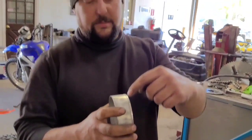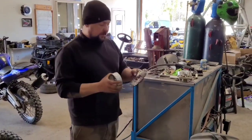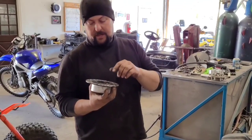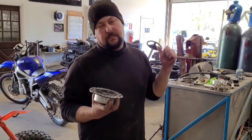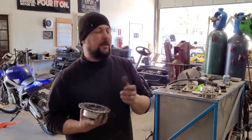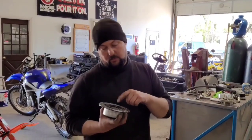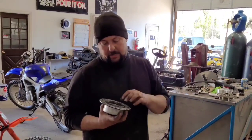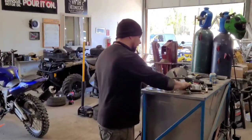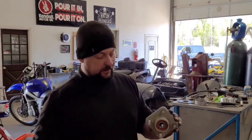So what I'm gonna do is weld that guy onto there, and then I can re-bolt the rotor on there, center it up, and then because of clearance wise and stuff, it's a little bit tight on there. The bolt heads don't fit. Either way, I wouldn't really be able to service it, so I'm gonna weld the rotor on here. I already did it that way on the other side. And then I just gotta take the original spindle off the golf cart.